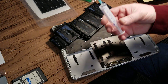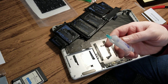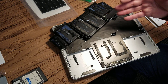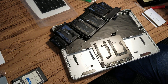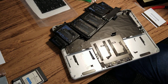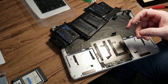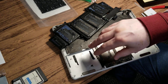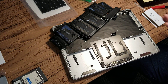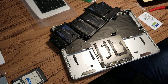One issue: most people would not be able to get syringes with needles, though you can buy them online. But you don't really have to use a syringe — alcohol will not damage your electronics, so you could just pour it carefully. If you can't find any kind of dropper, just carefully pour some alcohol in. The capillary effect will feed it in. Let it sit for five minutes and it's done. Get a credit card, get it in there — problem solved.